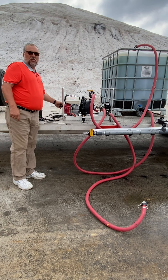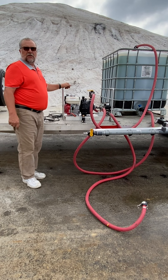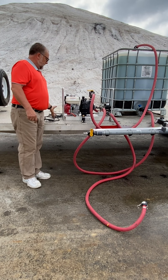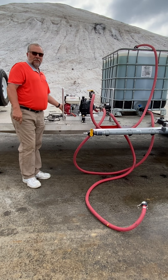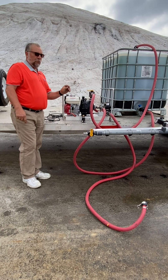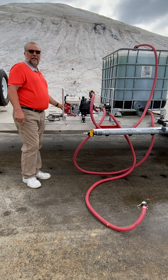Spray it down with a lubricant to keep it from corroding. If you don't clean or maintain this, you won't be able to pull it the next time you go to use it because it sucks air — you're spraying brine, you're sucking brine air. Little particles of salt will get in and rust the flywheel. You've got to maintain that and keep it lubricated.